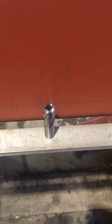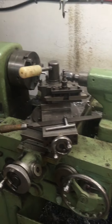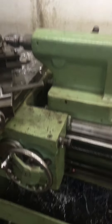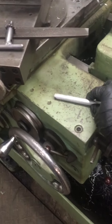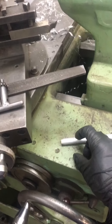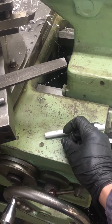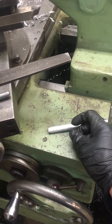Here's an annular cutter, just to give you guys an idea. My pro tip is the way to find the center of the hole with an annular cutter, just to make sure they're accurately spaced where they need to be. So here I am at the lathe. My plan is to take a piece of aluminum round bar, something like this, and mill it down to make a slug or a plug that will fit on the inside of the annular cutter.